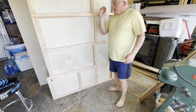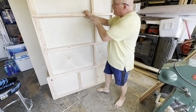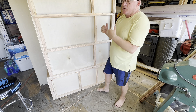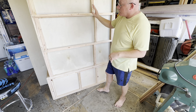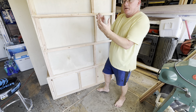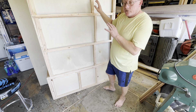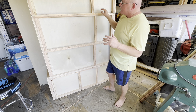You can get another look at what this frame structure looks like — all laminated cedar. A lot of people go with two-by-twos, which is totally fine. I just prefer this. The cedar's lighter, and when it's laminated together I think it's stronger. It's also easier to make sure I have nice, straight pieces. My experience with a lot of two-by-twos is it's very hard to find very straight pieces. When you're laminating cedar, if a board kind of angles off a little bit, you can always correct it and clamp it down in the glue process. The cedar is very stable, very resistant to rot, and in my view a very perfect material for something like this. It is very lightweight.